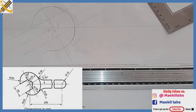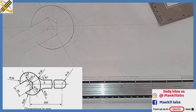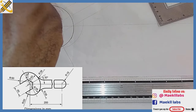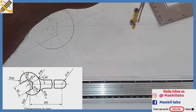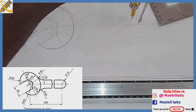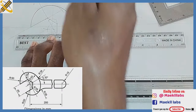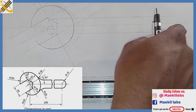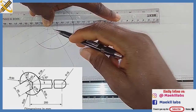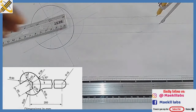The next thing is to complete this area here. Pick your compass and measure radius 15. With radius 15, come to the midpoint here and strike an arc, then strike another one at the top. Join them together with a faint straight line. We are told the distance from here to the back is 200, so from the midpoint to the back is 200. On the scale of 200, with radius 15, produce it.